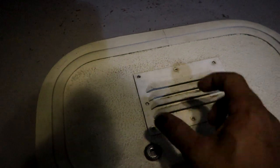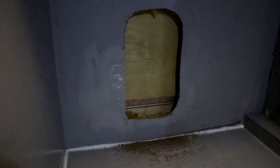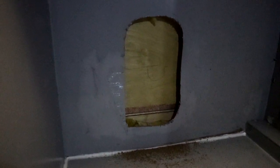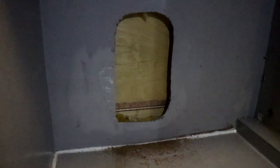I'm going to install this vent into the door right there. I'm going to drill two larger holes so there's an in-and-out airflow, and I think that will work really well. I went ahead and painted the areas I'd missed. This paint takes an hour to dry and four hours to cure, so in about four hours I'm going to put a second coat on. I don't think it'll require more than two coats. This is also a no-VOC paint — no Volatile Organic Compounds — those off-gas and give me a headache, so this one doesn't, and there's no smell. Two coats will do it, and once I get the second coat on and let it dry, I'll install the door.